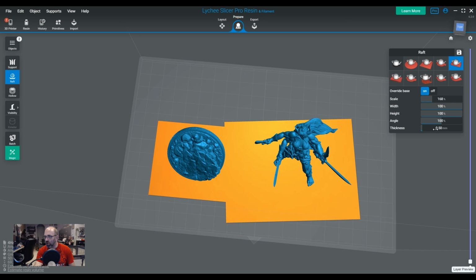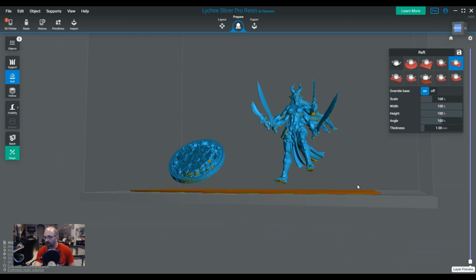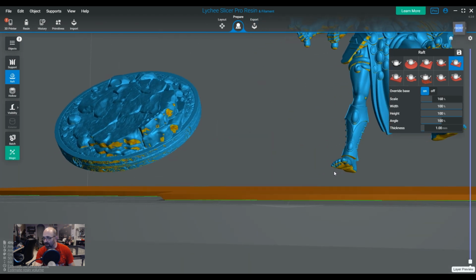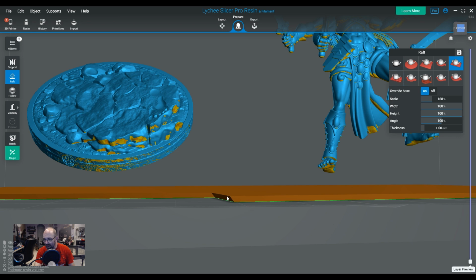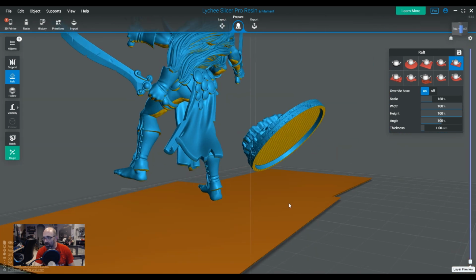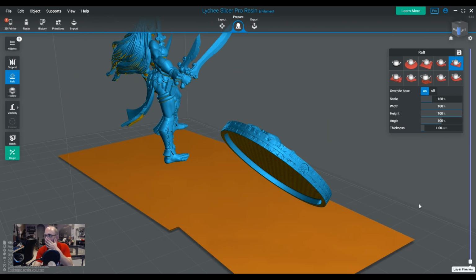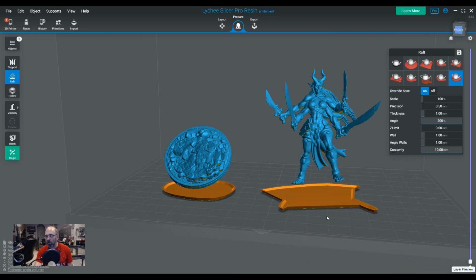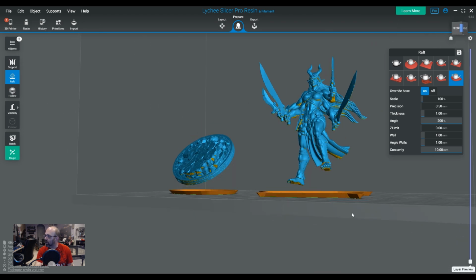And then what you could do is you could actually make the thickness slightly thicker than your support base tips. And that's a nice thick 1 millimeter piece. It's got a little bit of a beveled edge there. So that would work too. For my intents and purposes, though, I'm going to go with my shape wall because I really like the shape walls. They use less resin, and they're pretty accurate for popping your things off, and you don't have to worry about it.